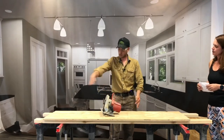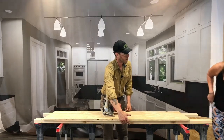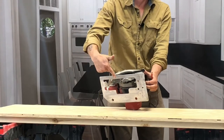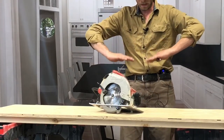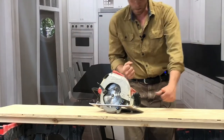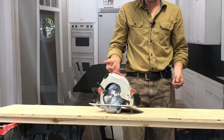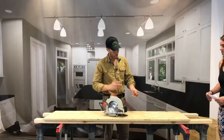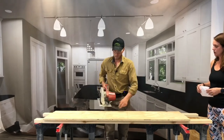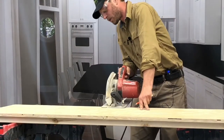This is the most important thing — I've got these two-by-fours supporting my cut, and my blade depth isn't cutting all the way through the two-by-fours. If the weight of the material is in the middle of the saw horses, it's going to come down as I'm cutting and just turn into a disaster. Planning your cut and supporting your cut is critical. I've got my depth correct so I'm not going to cut through the two-by-fours.